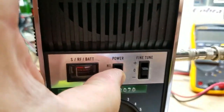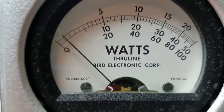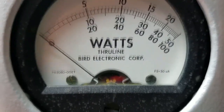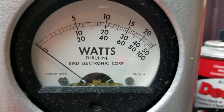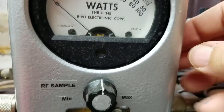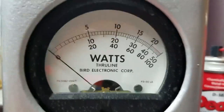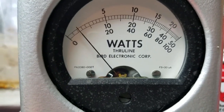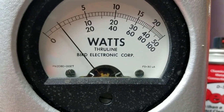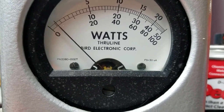We are going to put the radio on high power mode now. And there's 2 watts. 1-2. So, 2 watts with an RMS of about 3. Now, this radio was rated at 5 watts, if you remember. But I've got low batteries and this radio is vintage 1974-1975, so yeah, there's going to be an issue here. Let's put it in peak reading and get some feel-good watts readings. Hello. 1-2. Hello. Radio. So there's 6 watts. And if we just do audio — 1-2-3-4-5 — it will easily hit that 5-watt mark, not a problem. That's on high. Let's go down to low and see what low does. 1-2. Hello, radio. 1-2. There you go — battery saver mode. About 2-3 watts. That's not bad at all.